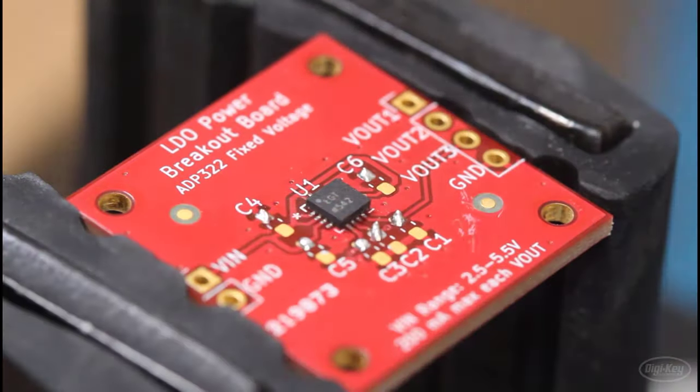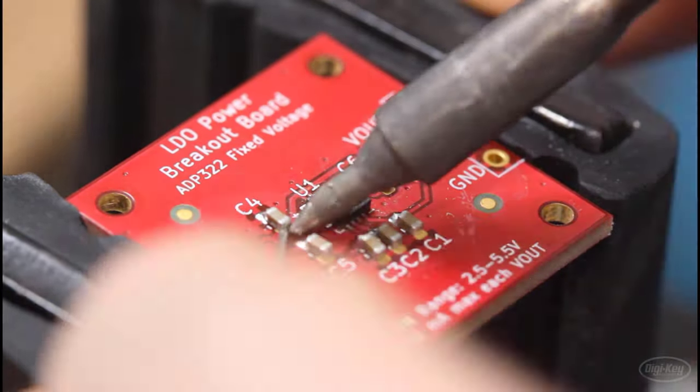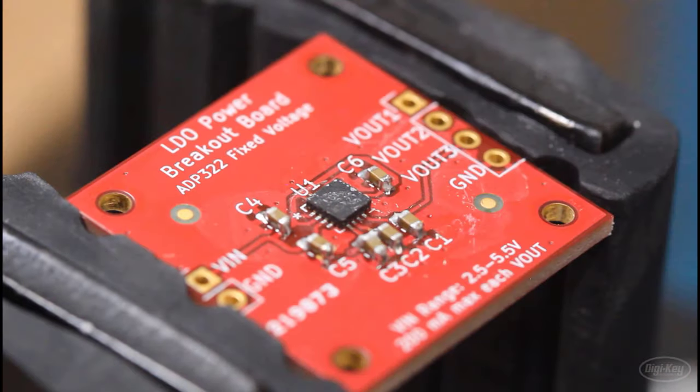When you're done, you can assemble the other components. I recommend working from your most complicated part, like the QFN you just placed, and going out. This may not always be the case, but I generally find this to be the easier strategy when trying to assemble a board by hand.